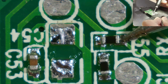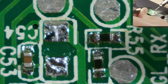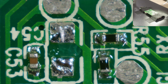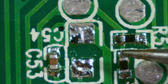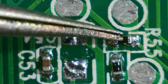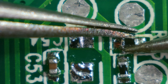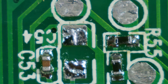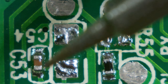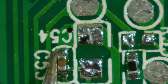Let's see if I can move the parts off without even using the tweezers. It's not that easy. I'm going to put some more flux in and raise the temperature to 400 — perhaps my temperature is a little too low. I'll try from the side to get both contact points. I'm going to push from the other side with the tweezers and heat it up — and there it finally goes. Let's try this capacitor over here. It looks like you have to put the iron on both contact points or on the side and then push it over.